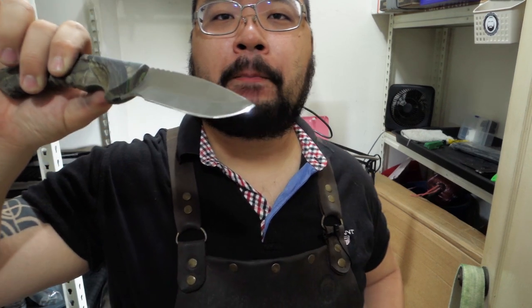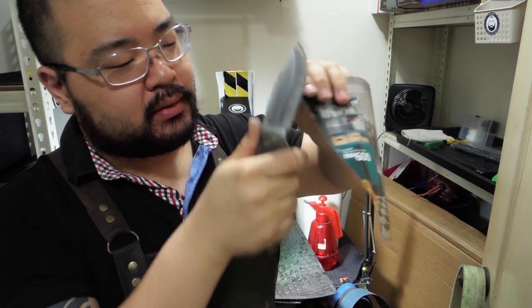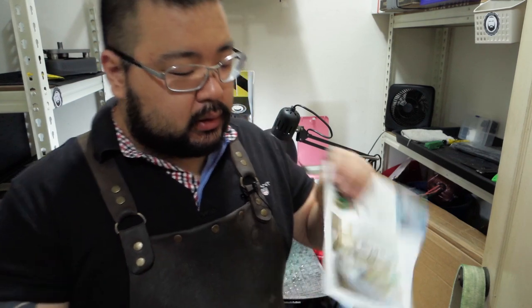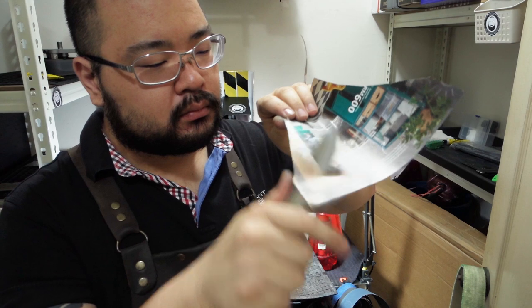Alright, sharpened it up to a nice mirror — this is the regular plus finish all the way up to 2500 grit. Let's see how I did. It's not too bad. In a repair like this the grind gets a little more obtuse, and unlike a flat or convex grind, this is hollow, so it's not that easy to thin it out behind the edge. One of the only ways is to give it a higher bevel or a lower angle on the edge, but it does seem to be cutting nicely. Anyway, thank you guys for watching — if you like this kind of knife repair video, give us a like, subscribe, and share with your friends. We'll have more content coming up in the future. Until then, stay safe and stay sharp.